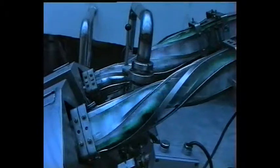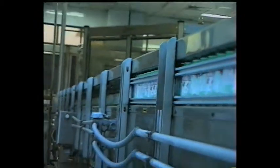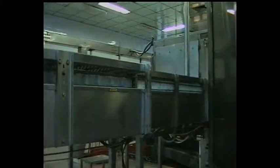All cartons will then continue their journey upwards to the second level, and then straight across the 50-meter bridge, which connects the production building to the opposite storage building. The cartons are brought to the Weyard CPA 555 Model Palletizer, which stacks 85 cartons into pallets every minute. The soft-touch and high-speed capabilities of this versatile machine result from a unique combination of design features, all with demonstrated effectiveness.